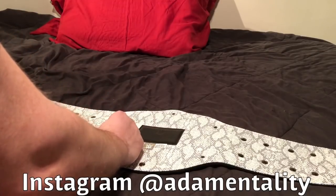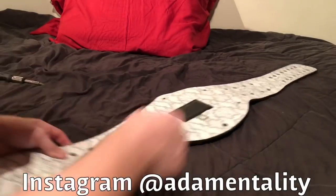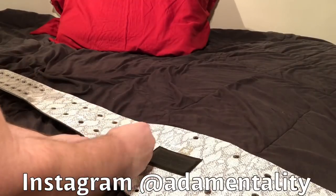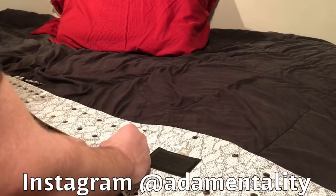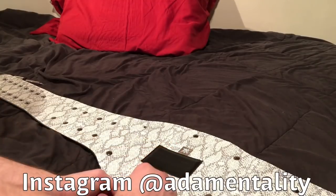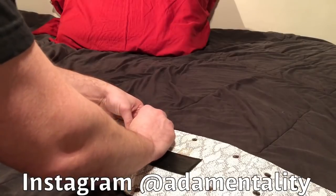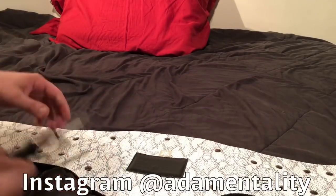Oh man. But I already can tell this is going to look a lot nicer than it did. I said, it's all about preference. Some people like them flat, and that's fine. I just prefer a nice deep curve on my main plates, because it really makes it pop, in my opinion. But that is my opinion. Not everybody likes to do it, and there's nothing wrong with that. Like I said, I'm just going around putting all the screws on slightly so the leather and everything lines up perfectly. And then I'm going to go back with the flathead screwdriver and tighten them all slowly, like I said, because you do not want to do it too fast and too hard because you will strip the screw and then it'll break inside, and then once again you're screwed, but not like that screw.